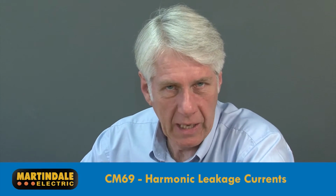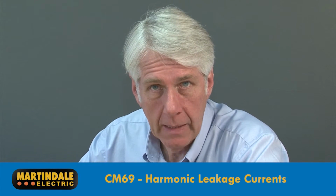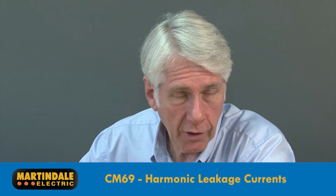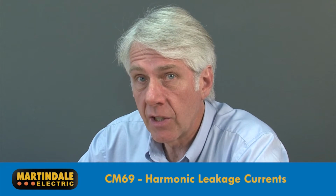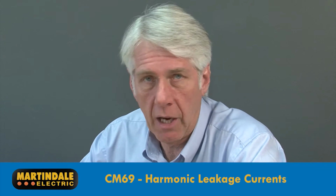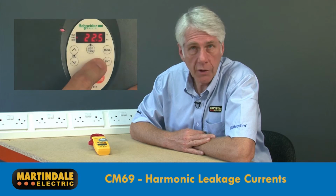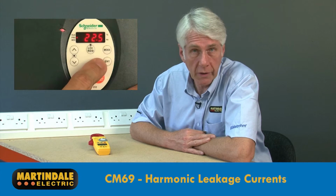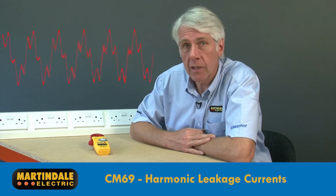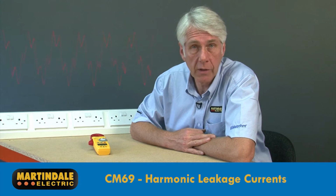Another application for the CM69 is the identification and reading of harmonic leakage currents. These can often cause sensitive electronic equipment to malfunction. In addition, some RCDs are more sensitive to leakage currents at harmonic frequencies than at 50 Hz, causing them to trip at lower currents. A common cause of harmonics are electronic control systems, such as those used in variable speed drive controllers, LED lighting, and UPS systems. These can generate harmonics at a range of frequencies leading to distorted waveforms with higher frequency components.